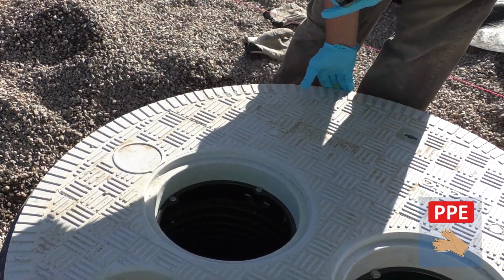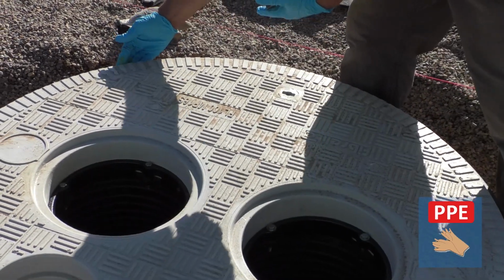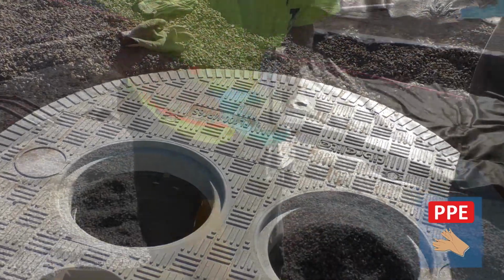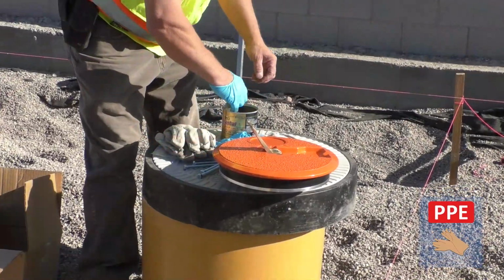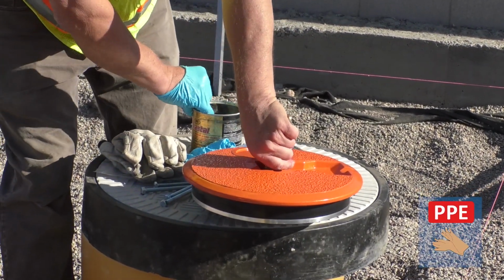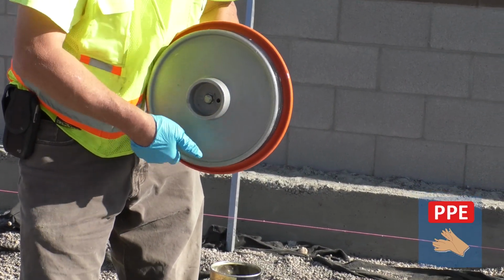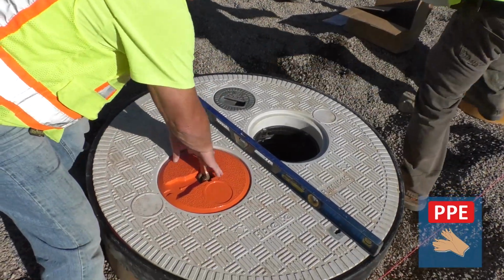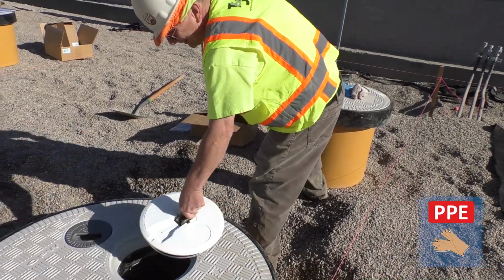Once the spill buckets are properly connected to the covers, both the fill and vent port covers and the inspection port cover should be installed. Apply white lithium grease to the gaskets of all covers prior to installation. OPW recommends the use of white lithium spray grease. If installing sealable port covers, make sure that the levers are fully depressed after the covers are installed into the port openings.